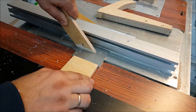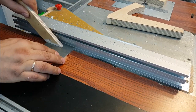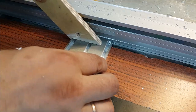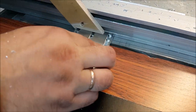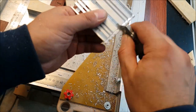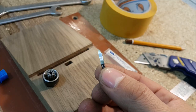Let's start to cut aluminum to make the LED cooler. Here I am making parallel mortises from both sides crosswise. I am trying my cooler in place and going to make a logo engraving. This is a 45 degree engraving bit. I am adjusting the zero position and starting the CNC.